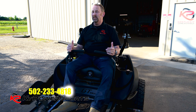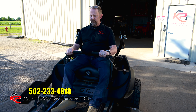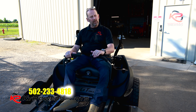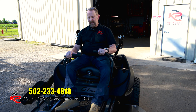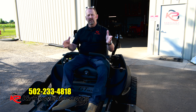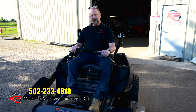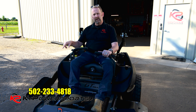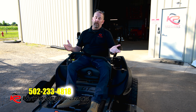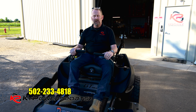If you want to back the mower up it's just the opposite — you just pull it back. Now if you want to make a left-hand turn, on your left hand stick you just pull back a little bit and give the right one more and she'll go left. Bring her back to the straight position and the mower should go straight again. If you want to go right it's the same thing — bring back that right stick just a little bit, keep the left one forward and she'll spin around. I can maybe relate this to pushing a grocery cart — it's almost the same exact motions.